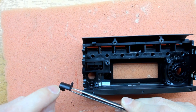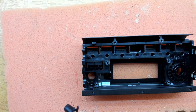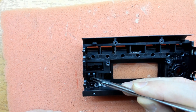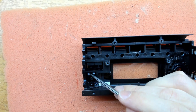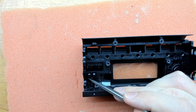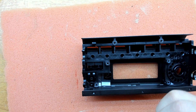The button mechanism has a very thin plastic hinge on the end, which sits in a recess with very little securing it. I don't know if it's been damaged in transit or had an issue before. The plan is to use superglue initially to get it in position, then add a thin piece of plastic with more surface area to act as a reinforced hinge.